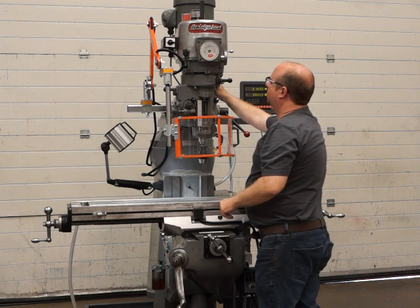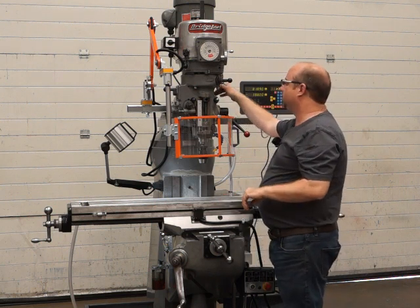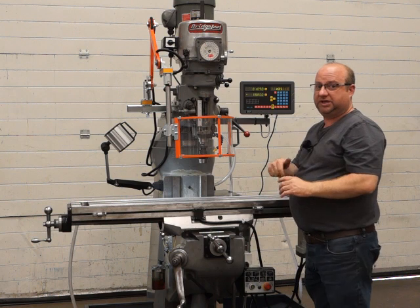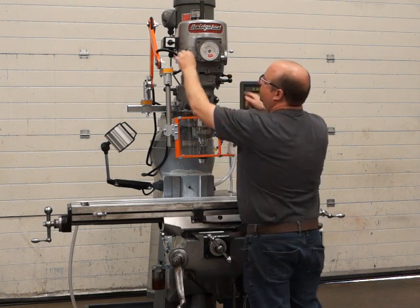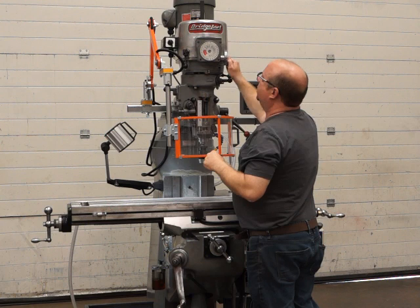So, also going from low now to high, but before we do that we'll go to neutral. So the neutral, there's a little notch there for neutral, and that allows you to freewheel on the spindle there, clocking any PCDs or whatever you need to clock. Right, get it to high, make sure you're locked in before you fire up, and you see it swaps over just fine.